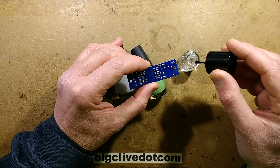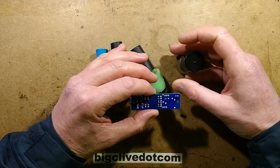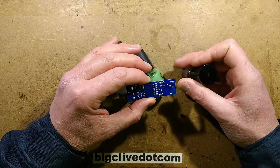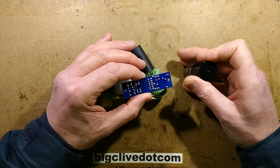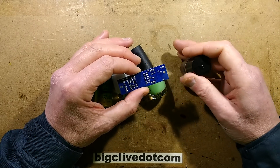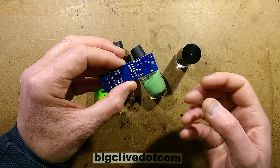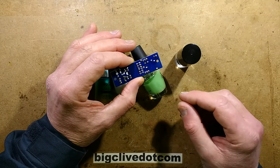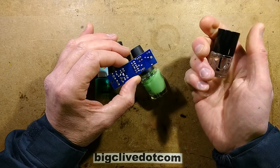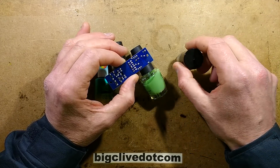It's called tropicalized lacquer because it's designed for highly humid or hot environments. One disadvantage of the aerosol lacquer is that if you've got components like potentiometers, you have to try and cover every crevice that the lacquer could get into. So if you just want a small dab, clear nail lacquer is a good option.